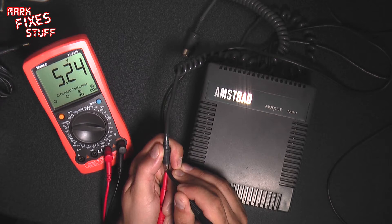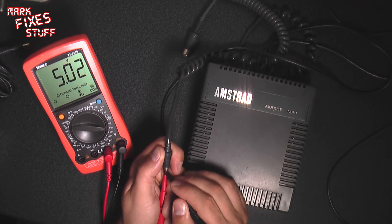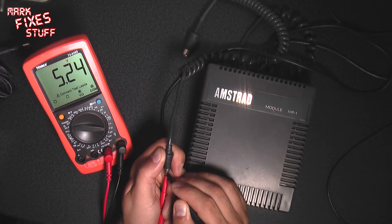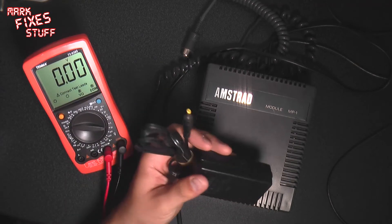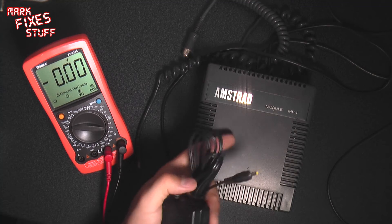So basically what we want is 5 volts - up to 5.24 would be fine. The regulators are in here and they do have a plus or minus tolerance, but to be honest that regulator is probably on the way out in that unit. If I was going to keep using this I'd replace that, but we're not going to bother because we are going to basically hack a barrel plug onto a replacement supply. I'll see you in a moment when I've reconfigured my desk and got rid of this.